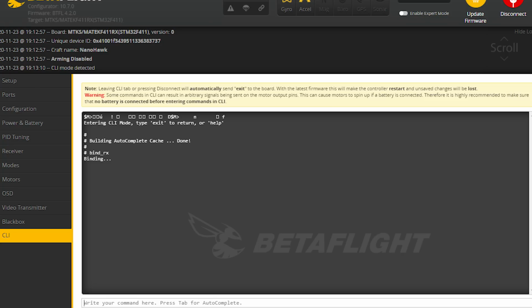After a night's sleep, it dawned on me I should test D16 mode. Maybe this new board has got some new magic within the receiver, but unfortunately, no, it does not. D16 mode still has poor range. D8 mode is going to be the way to go. That's what I'm flying in this video.